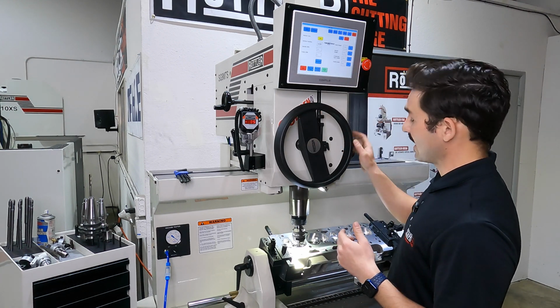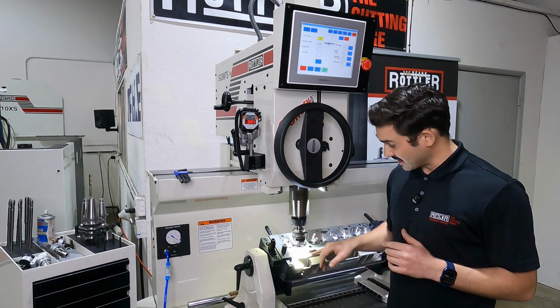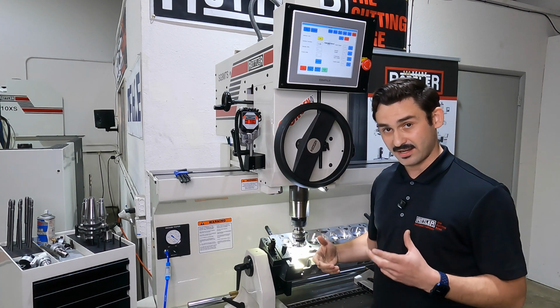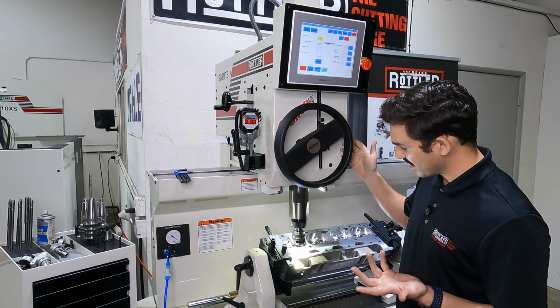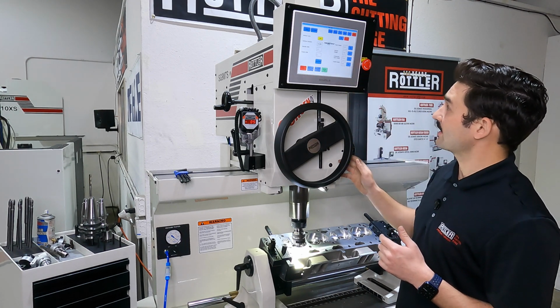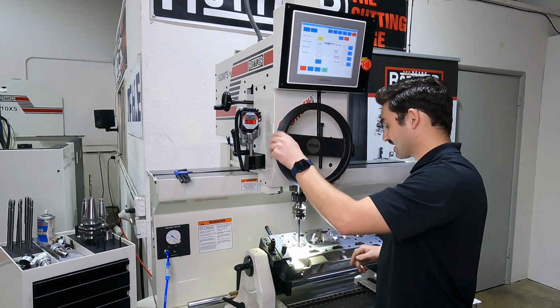My centering height, or my start height, is where the spindle is going to turn on. Where I always want to set this is that position we found earlier, where the pilot is registered on its taper in the guide, and my tool is moving up and down on the pilot post itself. So I just come in here, and that looks about good. I'll press set.